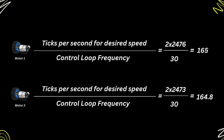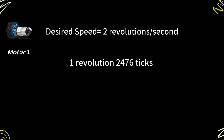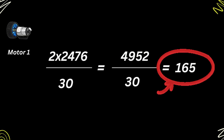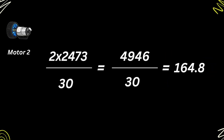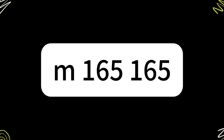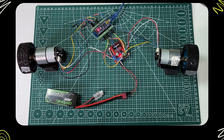How did I get those numbers? By using the following formula. For motor 1, we want it to rotate at two revolutions per second. Each revolution produces 2476 ticks and the control loop frequency is 30 hertz. So the final number of ticks per control loop is calculated accordingly, and the same applies to motor 2. Then the final command is formed. If you launch the serial tool and connect to the Arduino, you can send that command and the wheels should spin at two revolutions per second.